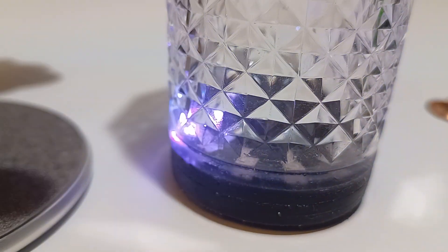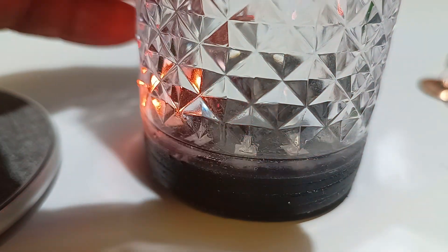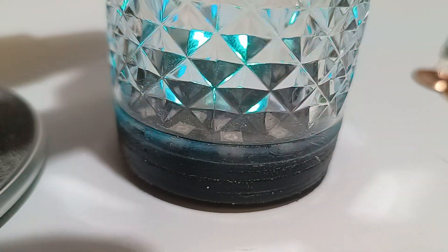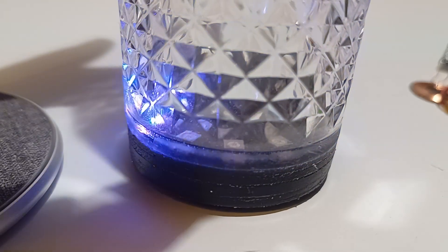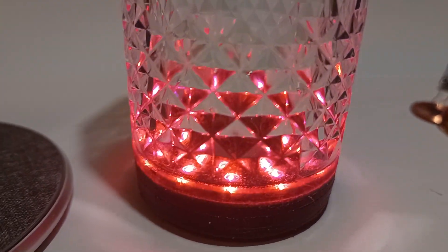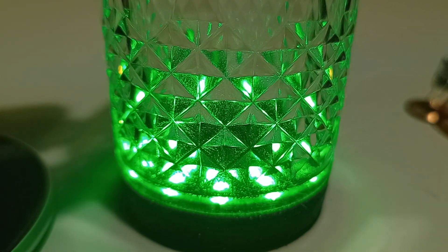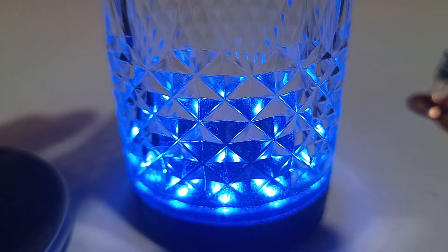There are six different patterns programmed in and it just works through each pattern. Some of them are random flickering, some of them are cross-fading, swirling rainbows, all that sort of thing. The idea is that when it's off — when you first see it — it has a little timer. It runs for 180 seconds, which is like three minutes, after which it goes to sleep. Now the sleep mode isn't quite working as I'd hoped. It does go to sleep and does conserve the battery to a degree, but I've got it on the wrong side of a boost-buck converter. I'll post the modification on the GitHub page, which I'll link at the end of the video, so you can get the circuit and the code.